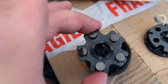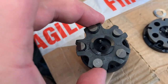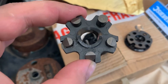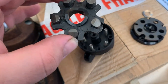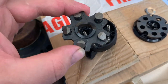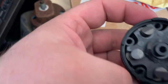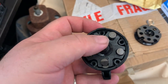At the moment we've got our four pins still like this — the fixed one and the four that go down. What we need to do is swap two of these around so that we can move it to the shoulder strap. That's how we want it to go back in now. You need to line up the bottom of the pins with the springs — I'm just going to turn the camera off while I do this. Okay, so that's dropped back in. Now we can put the retaining pin back across there and the washer back on.